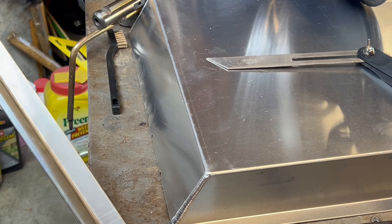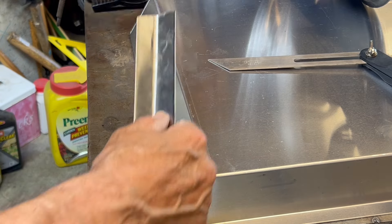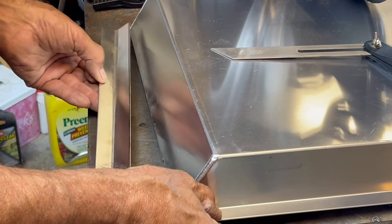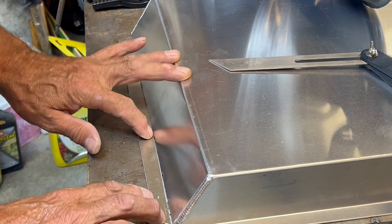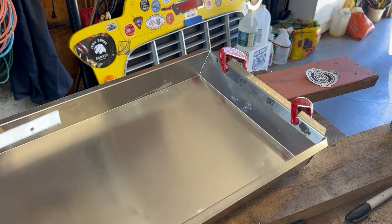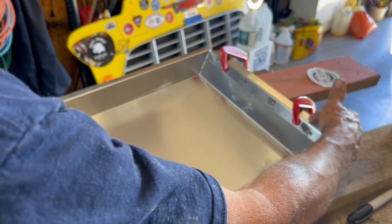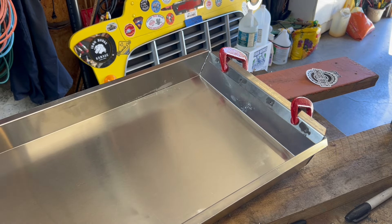We got this bent up — I cut it back about an inch. What I want to do is stick this flange up into the back side of the shroud, set that up inside the back like that. That gives us our little flange right there for bolting on to the radiator. I'm going to drill through these holes through the shroud so I can mount it up. I won't permanently mount it because I want to make the holes on the radiator from the back side of this flange, then nylock it down with quarter-inch when I'm all done.